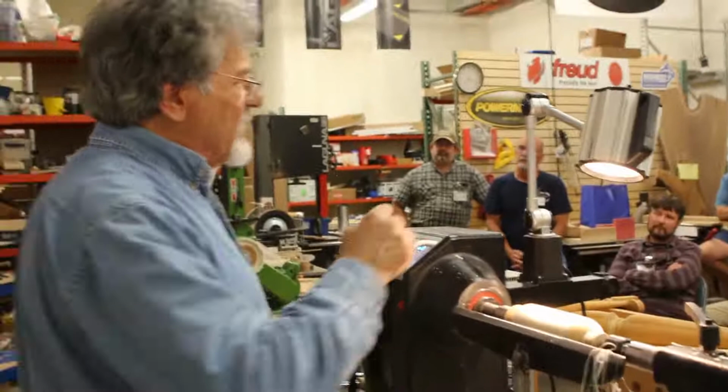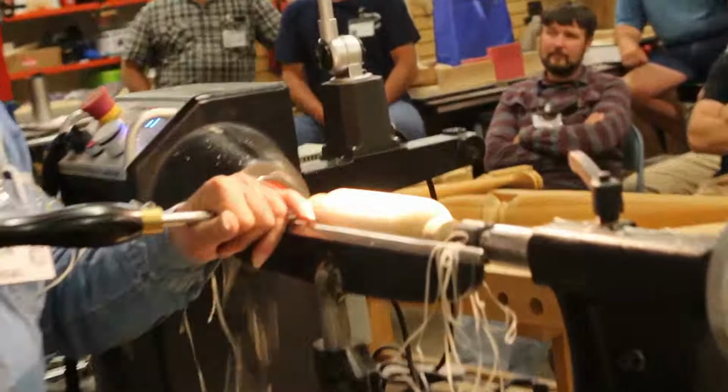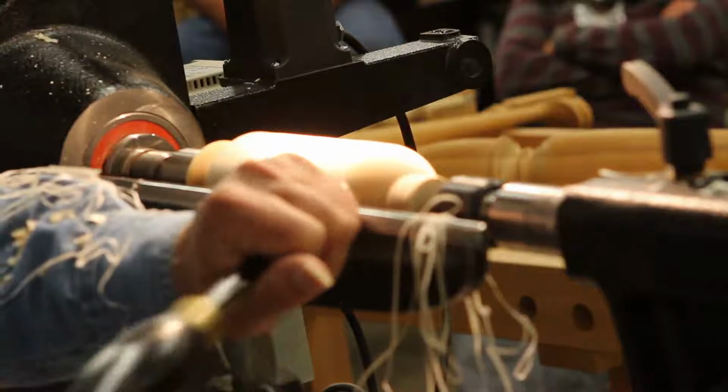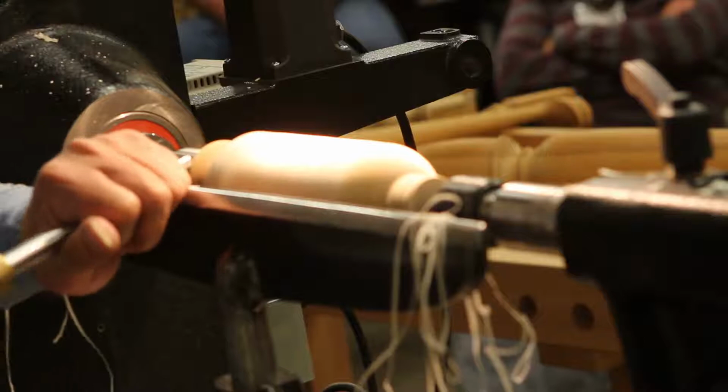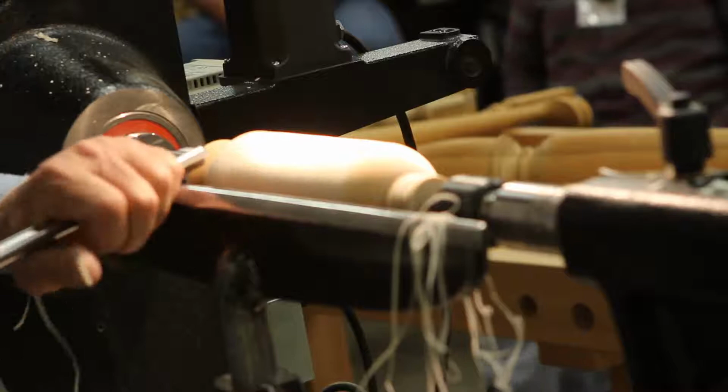And we'll talk about duplication in a few minutes. I'll explain a little bit more about taking pieces out and putting them back and how important that is. So doing the left-hand side is harder because I'm moving the handle of the chisel toward my body. Over here, I'm moving it away, so I can either move with it or just let my hand depart from my chest and be free. On this side, I'm moving it toward my body, so eventually it gets to a point where it's hitting me. And something has to happen. Either I can step back and pass it in front. I know some people even cut these handles off to facilitate that. I don't like that exactly.